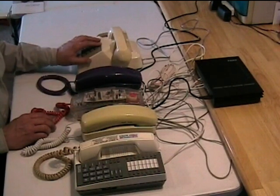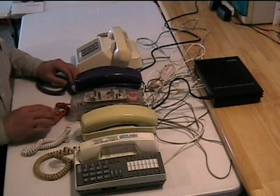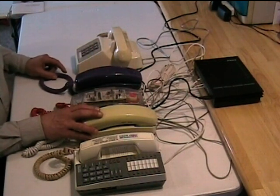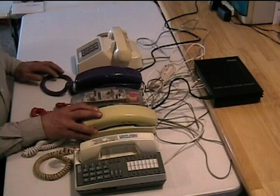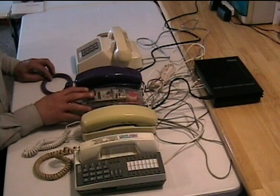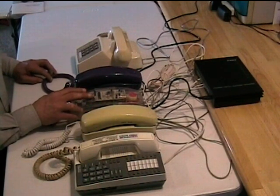I think it's putting out 60 hertz instead of the normal 20 hertz AC. The other thing I don't like about this unit is that when you call another station, if they don't answer by the fifth ring, it hangs up and disconnects, gives you a busy signal. I don't know why it doesn't just keep ringing until they answer. Other than that, it works pretty well — it'll take up to eight phones, and I've run lines between buildings with several hundred feet of line, my longest being six or seven hundred feet, though I do get a little hum on the line.